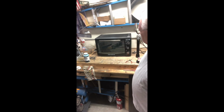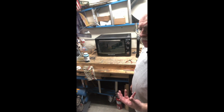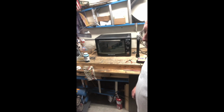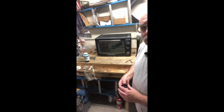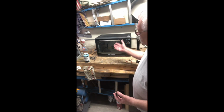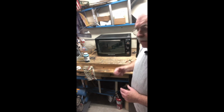we're cooking. So it'll only take about 10 minutes, and after those are done, it'll turn to a liquid. That powder coat gets so hot at 450 degrees it actually will liquefy. The rule of thumb is when you see it start to flow, turn the heat down and then just let it sit in there for 10 minutes or so, 15 minutes, and then it's done. And you can open the door, let them cool off. As soon as they're cool enough to handle, they're all set to go. You could start to reassemble them or do whatever you have to do to them.